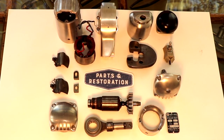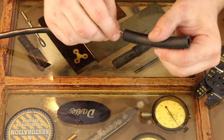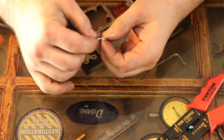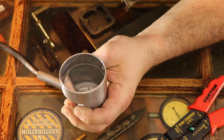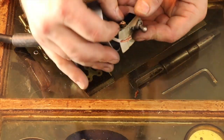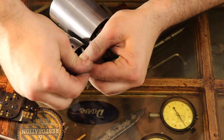Now we have all our clean, refinished parts ready for reassembly. There's my Southwire cord and some gas hose from McMaster-Carr. I made sure that the interior diameter of the flexible gas hose matched the exterior diameter of the wire. I'm just starting to rewire everything — there's my ground, the original switch buffed up with sandpaper, and you can see that old fiberboard they used to prevent arcing or a short through the casting.